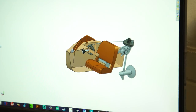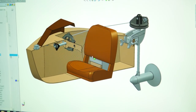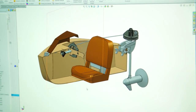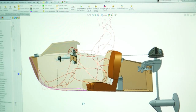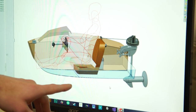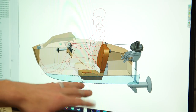Have you ever designed a boat before? No. I designed the entire thing in CAD before I cut anything, and I built a scale model to float-test it in my friend's jacuzzi. You do estimations in CAD — you know where your center of gravity and center of buoyancy are, and you can apply water properties to the hull in CAD. But then you really want a feel for it, so you build the scale model.